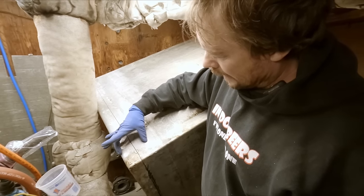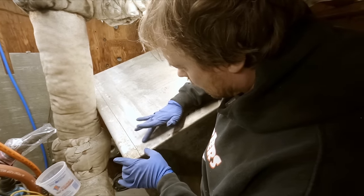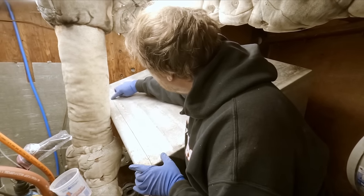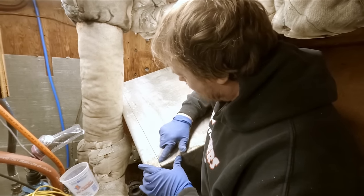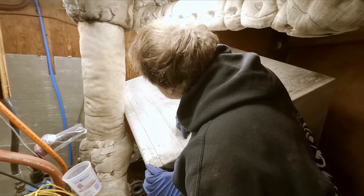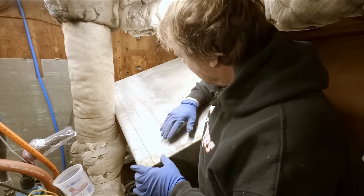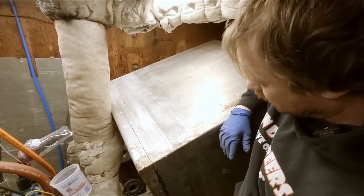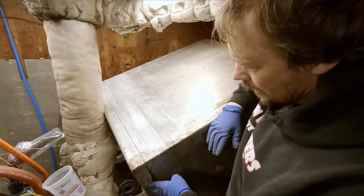And we can just bring this leg up a little bit long. Somewhere in here is good. I think we get past the bad corrosion at that point. Right here, there's kind of a deep pit. Right on this edge, it's a little bit nasty, but if we come up say an inch or so past that, then we'll be all on good metal. And I think that's going to be the case all the way around. We need to double check, but this was definitely the worst spots.